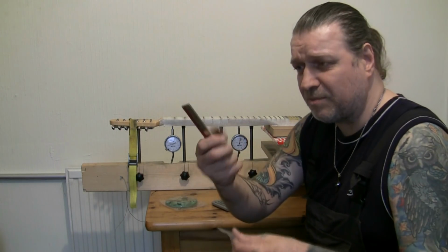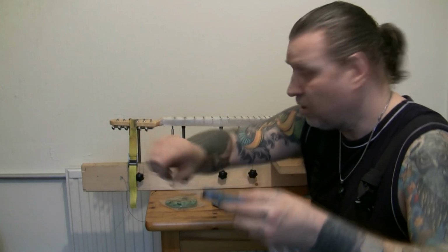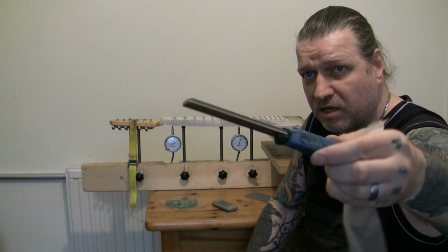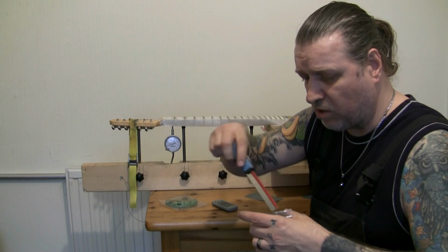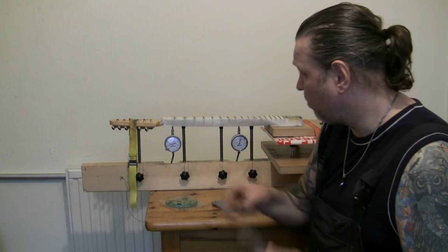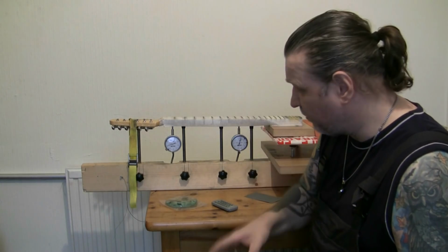I think it's about 300 grit, but it's coated with diamonds, which smooths off the frets and crowns them, because it's got a crowning edge there, look. It puts the crown back in them. Now I'd already crowned them anyway, but I always finish off with this one. Then all I have to do after this is, as I've got no 1200 grit paper, go across with 1000 grit, 1500 grit and 2000 grit, and I'll finish off with wire wool.